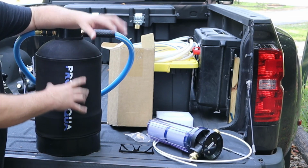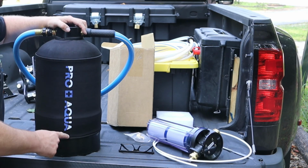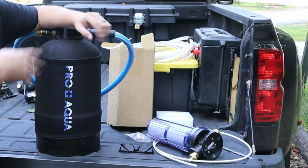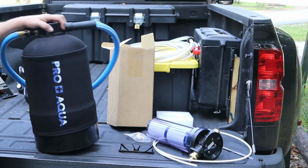You can just make sure you strap it in. It has to be installed upright like this. The water comes in, goes through the bottom, out of a strainer, is forced through the resin, and then back in the top, and it comes out. And there you go, you have your softened water. It cannot be installed on its side, so you don't ever want to do that.